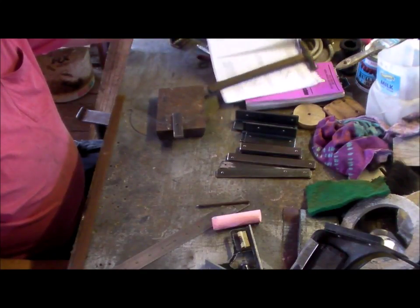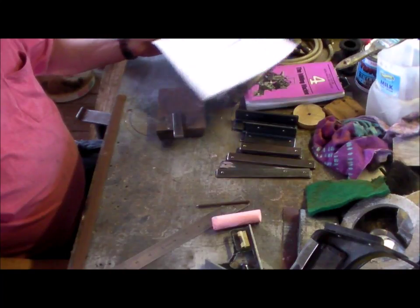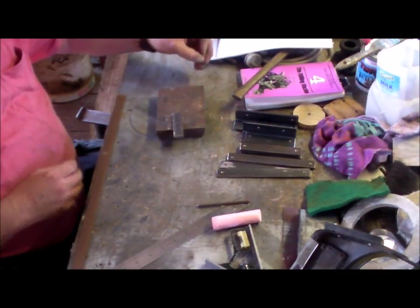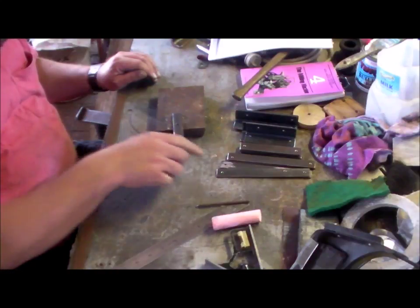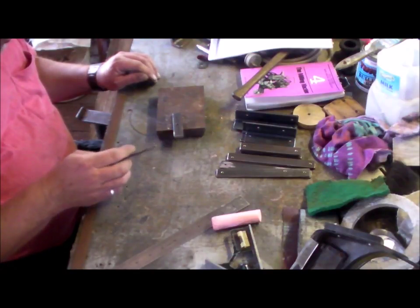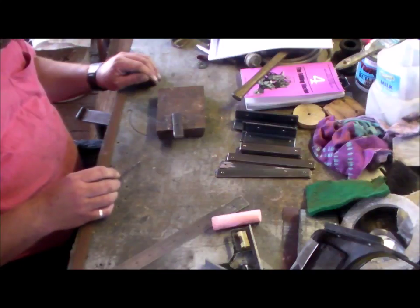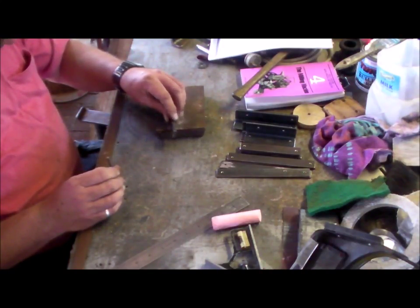This is still on the first stage, or the last stage, depending on which way you look at it. But the first part of the book, as we go into the transmission section. So I now have to start assembling some of these parts. Gingery calls for 3/16 the old style cold rivet. I think I'll keep in theme with that if possible.